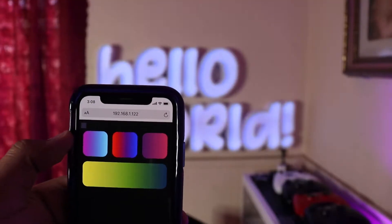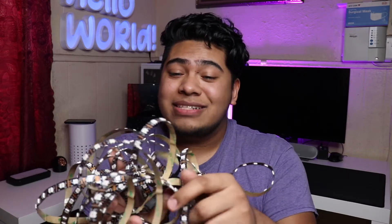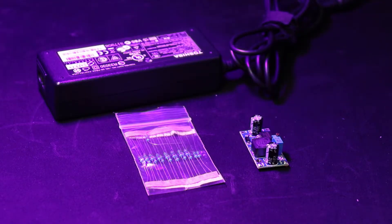This is important because ultimately we need a way to control our LED lights. And how cool would it be if we could control our lights wirelessly using an interface that we can design however we want? Now, that's only half of the equation. We need the other very obvious part to make the whole thing work, and that's the LED strips themselves. This bunch of strips right here are actually kind of unique — they contain a chipset called the WS2812B. This is important because it means every single one of these LEDs are individually addressable, meaning we could control each of them independently, giving us a ton of flexibility. With these two things, some resistors, and a buck converter to step down the voltage from this old laptop charger, we have everything we need.